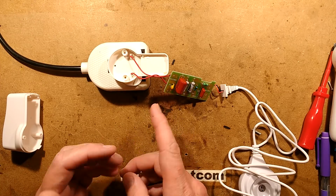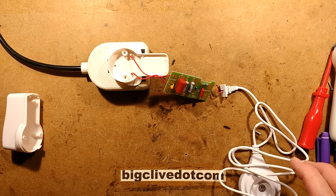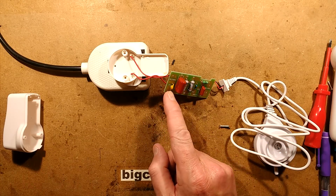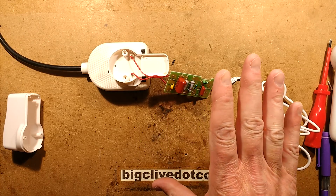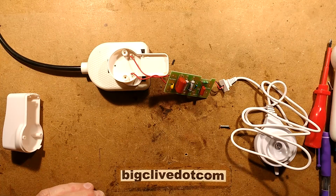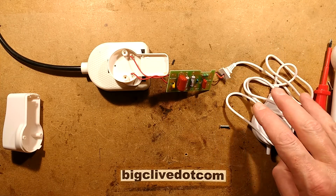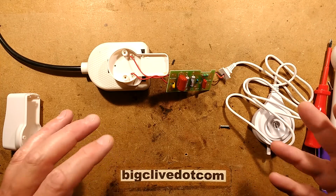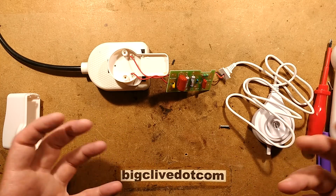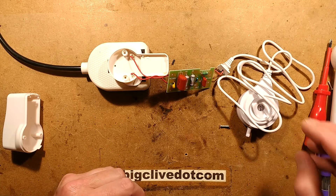It's interesting to have the PTC thermistor in series with it. What that does is: if the current gets too high — well above 30 milliamps — and that could happen if you had a lot of electrical noise because this capacitor would effectively shunt electrical noise — that could cause a momentary increase in current. If it does pass too much current, this little resistor will go to high resistance, but only until you unplug it and it cools down again, because it's thermally operated. And now to go and experiment with this — to see if my copper chloride etchant foams up again. The idea of copper chloride etchant is you leave it bubbling in the background and it replenishes with oxygen, but something is causing it to foam up and I'm not really sure how to get rid of that foam without contaminating the chemical.